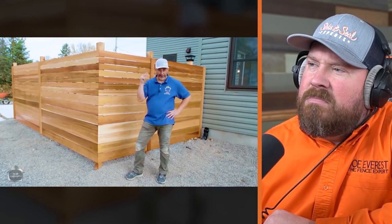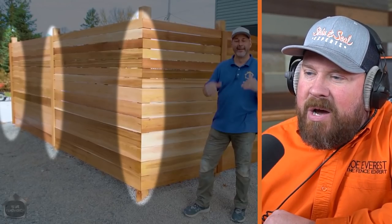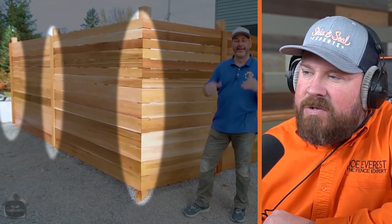It's a bit confusing that some of the joints are covered but some are mitered. I think if you're going to the trouble of mitering the corner, you'd miter your other joints too to make them less noticeable. Anyway, one way of building a fence here. According to Jeff it's a really quick way to build it, but I don't know that it's a long-term solution. Adhesives and brad nails don't seem to be recognized in the industry as a good long-term solution. Jeff's trying to sell this house quickly, so it probably doesn't matter if the stain fails in the next year or two and the boards start popping off. Let me know how you guys would do this fence differently in the comments below — I try to reply as quickly as I can. I'm Joe Everest, the fence expert, reminding you that good fences make good neighbors. We'll see you next time.